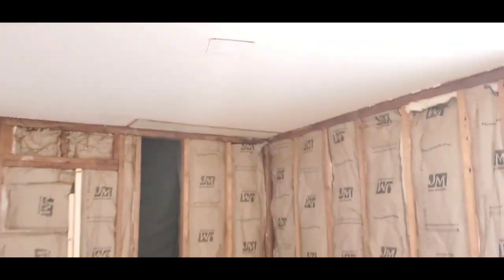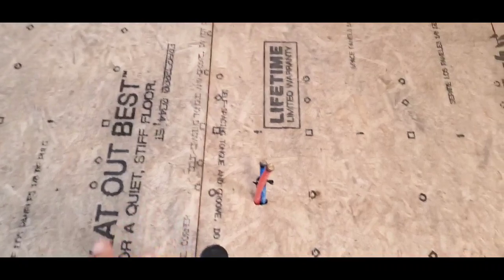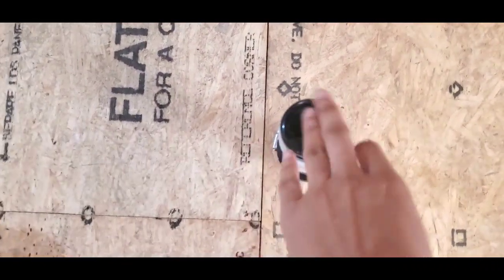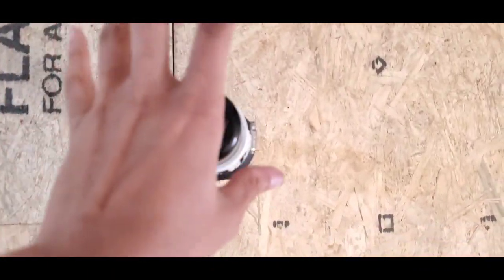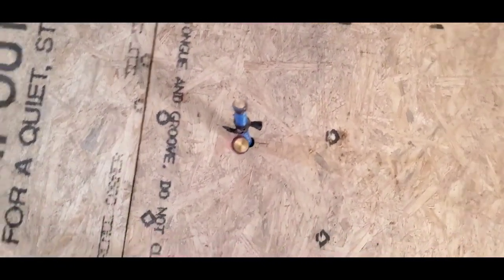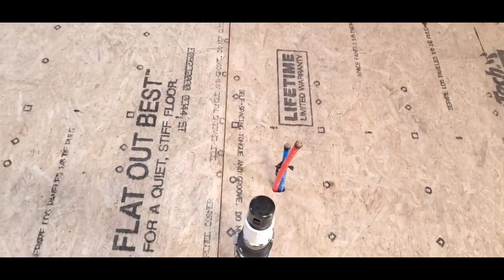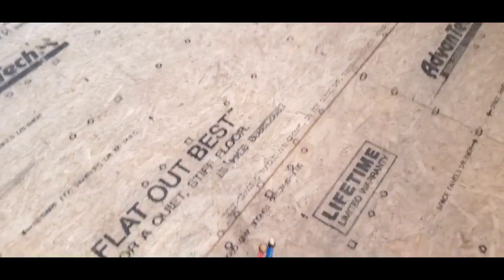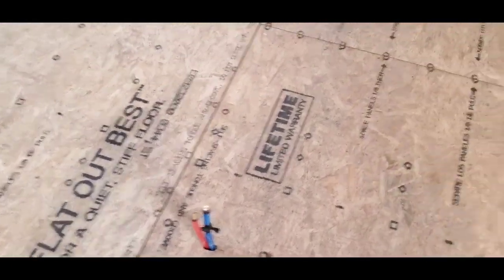What I am going to do is start drywalling this ceiling. My kitchen — look at my plumbing system. This is where my island is going to be. This is the inline valve so that when gases come up through the sewer line, it's not going to come up — it's going to flow back the other way. You change this every few years. That is my hot and cold line. I'm going to take a little garbage can or something and put it on top of that and seal it down so that my daughter won't be playing with this.